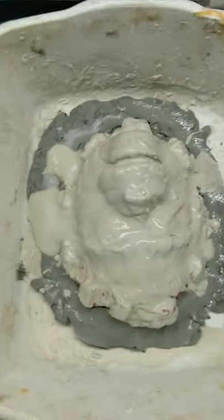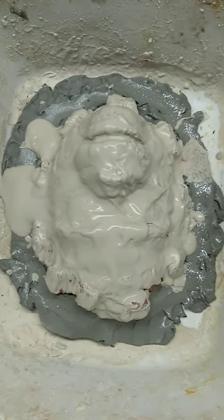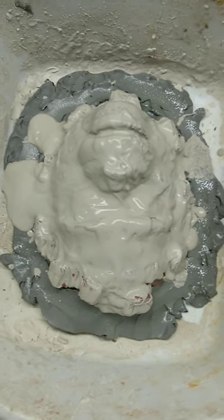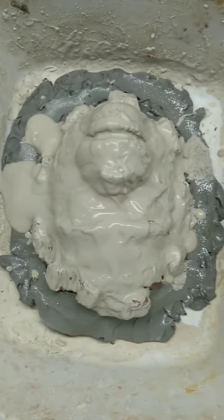The advantage of sulfur-free is that you can use silicone. Regular sulfur clay is a problem with silicone — it doesn't like it. Anyway, the first layer of plaster is in, and it's probably going to take about five minutes before you put the second layer on.